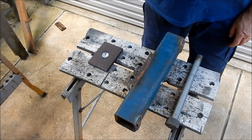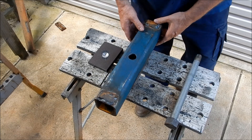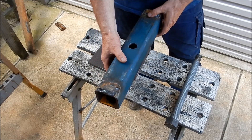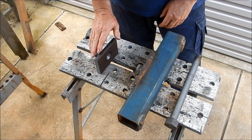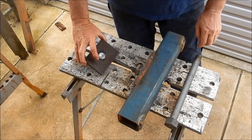I did show these in my previous videos but I'll just quickly run through what we've done. I've made up the strong back and this is the orientation it's going to be underneath the slab. These two points here are the points of contact as it gets pulled up underneath the slab, sitting down on that pile that runs down over two meters. This is the top plate that I've put a chamfer into there.